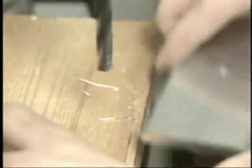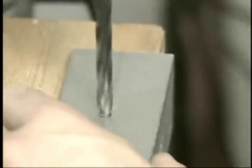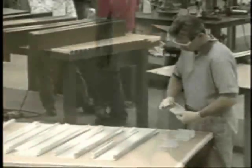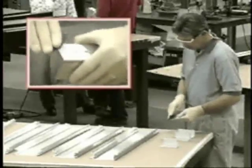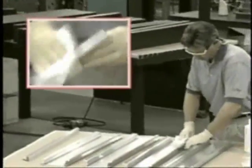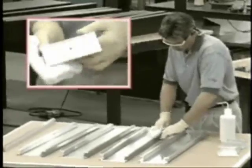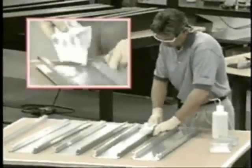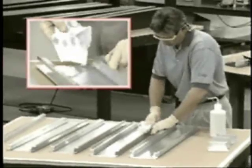Next, deburr the injection ports by lightly drilling the edges of each port with a bigger drill bit. Then deburr the edges of the corner keys and frame pieces with sandpaper, a scuff pad, or a file. Once all pieces are deburred, wipe the bond surface of each part with an isopropyl alcohol dampened rag to remove any waxes, dirt, fingerprints, and oils which may result in poor adhesion.